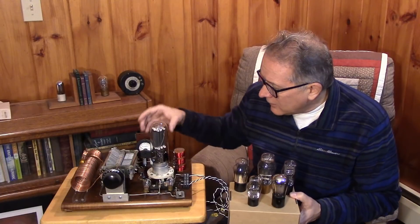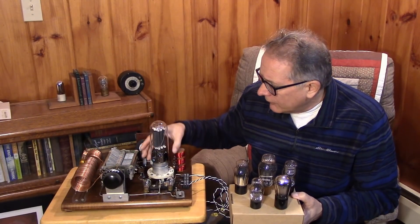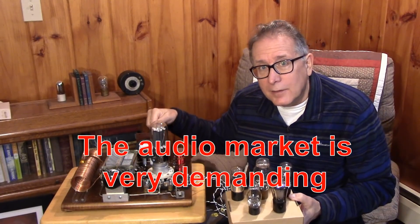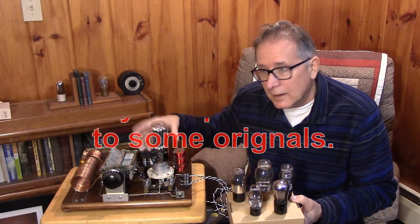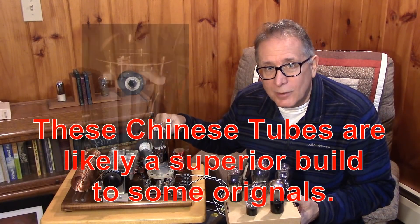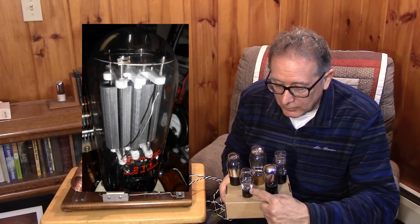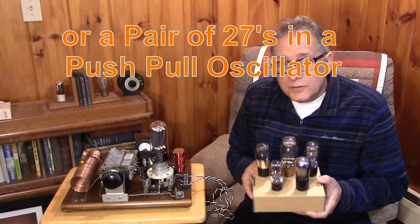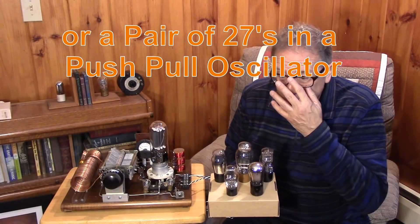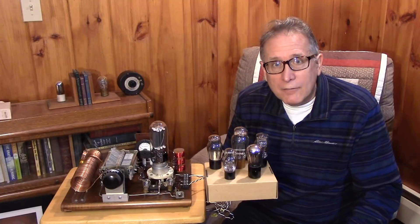A lot of these tubes were developed in the 1920s with the big globe-style tube envelope, going to the ST-style later in the 30s. Some tubes continued to be made in the 40s and 50s, but nowadays most of these tubes never died and are being manufactured again. So can I use a Chinese 203, 201, or 211 in this transmitter? Yes, because it's not the actual time of manufacture that's important — it's that the tube was designed in the 1920s. Here's a really popular one: the Type 27 triode. Putting one of these in a Hartley oscillator is a good way to start in this contest.